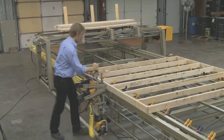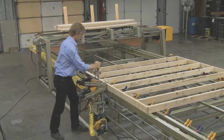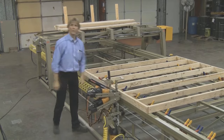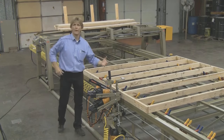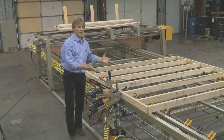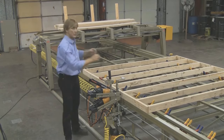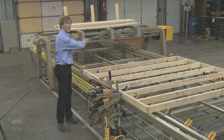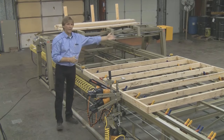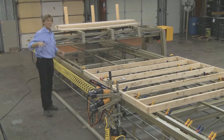You don't need a carpenter here — you can get general entry-level employees, put them on here, explain what's got to happen. Get your carpenter guy out here and he's running things. You have one guy on each side of the table and your carpenter is running the shop — he's the gopher guy, saying here's the wall you're building, here's the order, with all the studs laid out on the bucks as they roll them into the table. He's the guy reloading the bridge and keeping everything going.